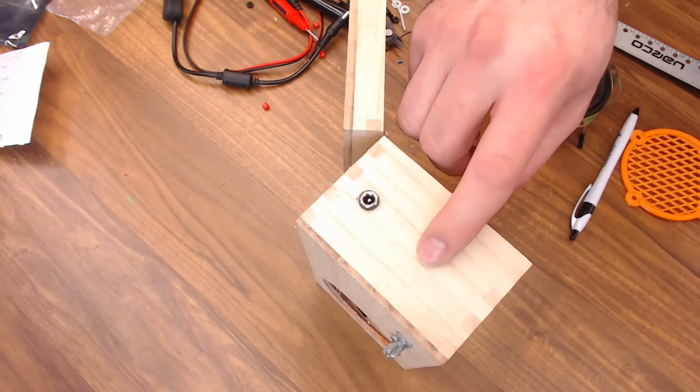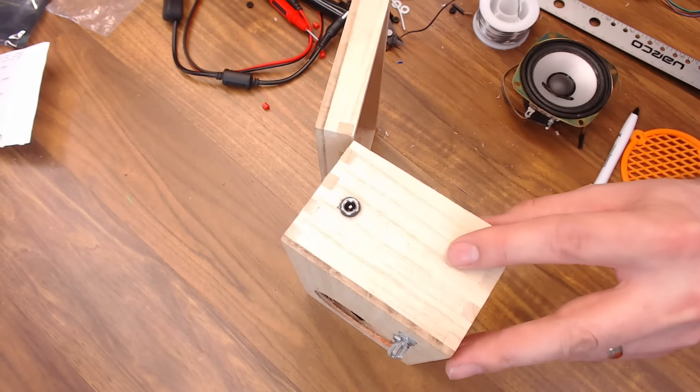The hole looks good. Let's make sure our speaker still lines up nice and straight — it's a pretty nice fit and the holes still line up for the screws. I'm going to use a 1/8 inch drill bit for the screw holes to mount the speaker; I have some number 6 screws that I'm going to use to attach it. I'm going to put the volume and gain knobs right here using a 5/16 inch bit so I can use the nut and washer that comes on the potentiometer to attach them. I'll put my power jack on this end with a 5/16 as well, and the guitar cable jack on the same side — that jack is a 3/8 so I'm using a 3/8 bit. Then I cut a hole for the base tube; it's 3/4 inch, quite a bit larger, so I used a paddle bit.